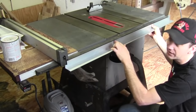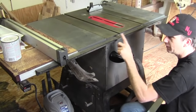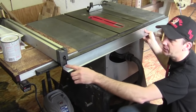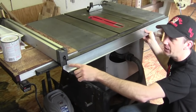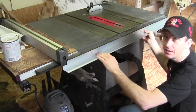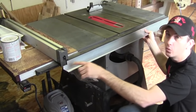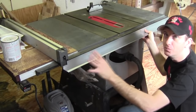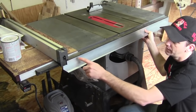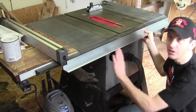We're going to go ahead and get these lined up. I'm going to make some hole marks to use the existing holes that are mounting this angle iron on and mount right to it. You'll see later in the video that where the fence rides, it will interfere with the mounting plate — the plate that the table pivots on. So we'll have to rabbet out the back of that so the fence can still move freely. Let's get started with the angle iron by lining up the holes, making the marks, and getting them drilled at the drill press so I can get this mounted.